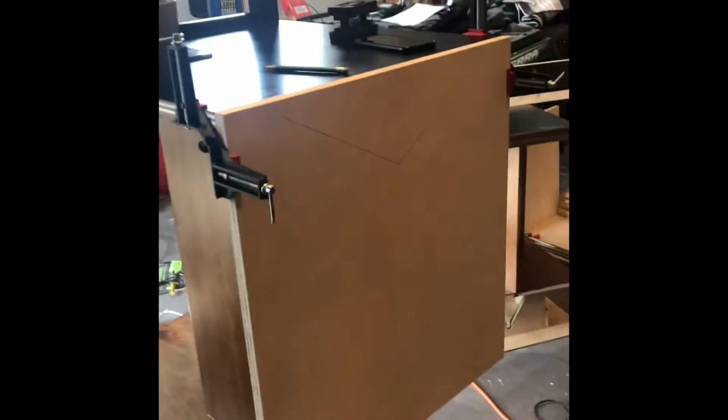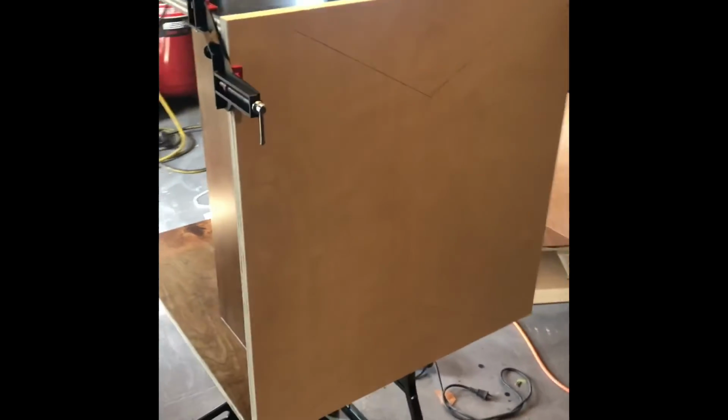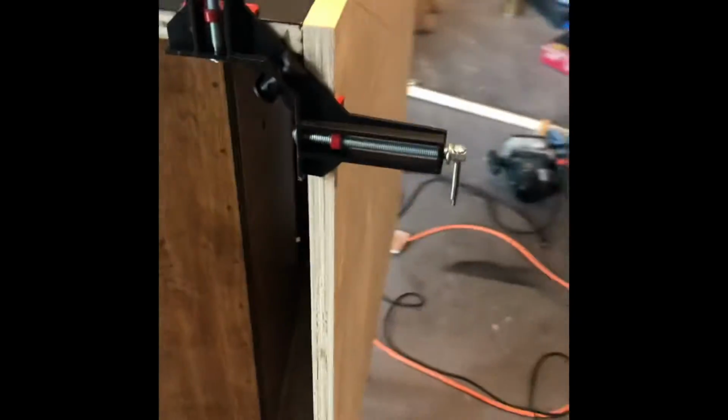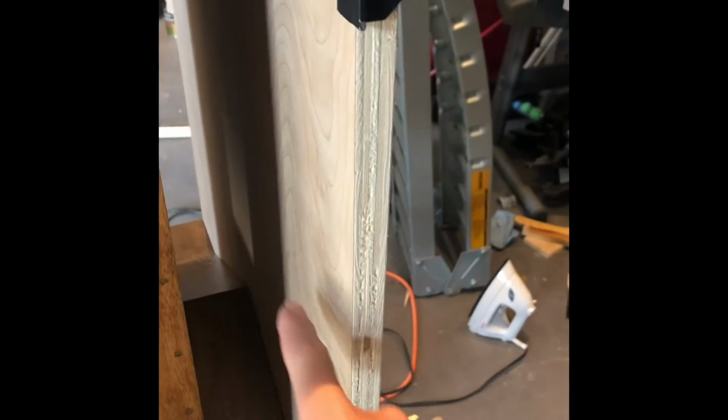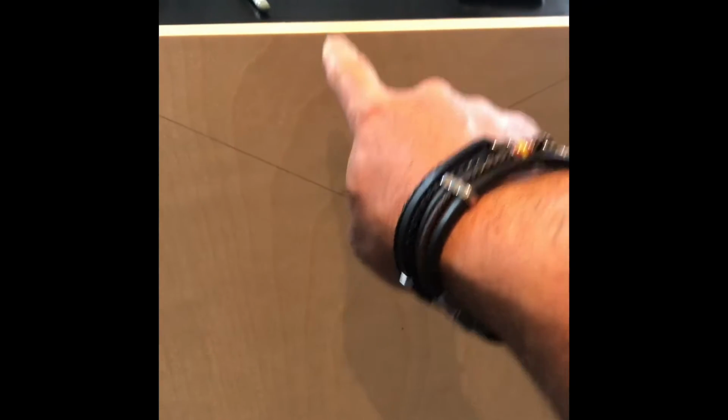So basically to put the back on, and I've already started this a little bit, as you can see. What I've done, basically, I need to mark this up to get it ready to put the splitter in. This is the actual inside of the back right now. I've just got it turned around, and I'll explain why in a second. But basically what I've done is I've mounted this piece here using clamps, and then used a pencil to scribe where the deflectors are inside, just to make sure we got a good mark there. What I'll do now is mark this section dead center,